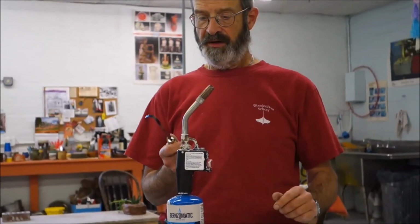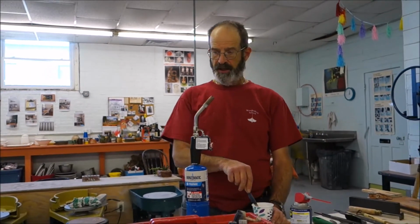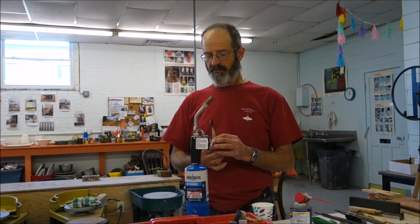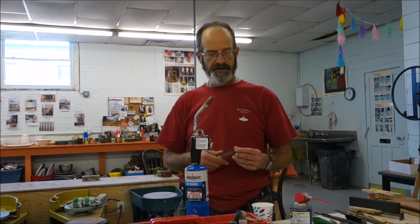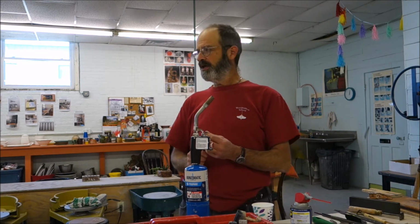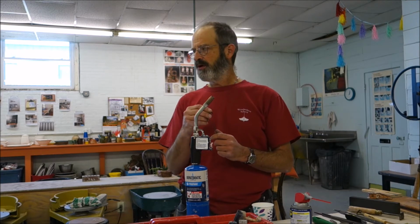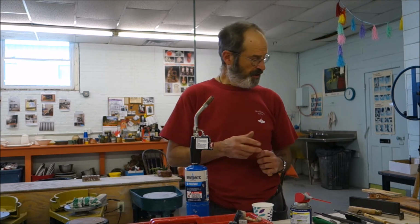The idea is you get something cherry red and plunge it, it makes the steel really hard. Like that's how they make files. Although some steels are designed to be plunged in oil and there are variations. But basically you quench really hot steel, it gets very hard. And typically in knife making, you do that first and get it really hard, and then they slowly reheat it to a dull yellow, and that tempers it, right? So it's not super hard. And again, now I can take a file here.